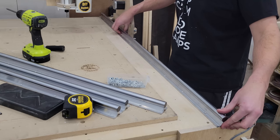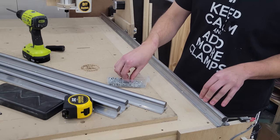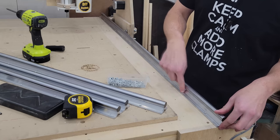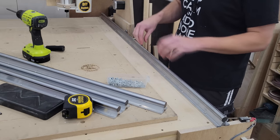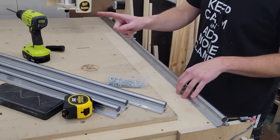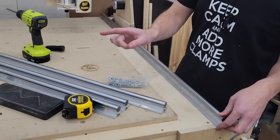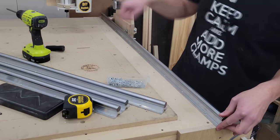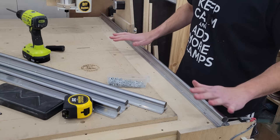So this is going to correct it for us. Now we'll get this rail attached down with 8 million of these screws right here. I'm going to use a self-centering bit in each hole, start at the ends, anchor both ends, then fill in the rest of the holes. Then we'll move on to the other side of the Y-axis. We're going to place that rail not based on the other DIN rail, because we know it's slightly off — we're going to place it measured off this rail to ensure everything is totally parallel.